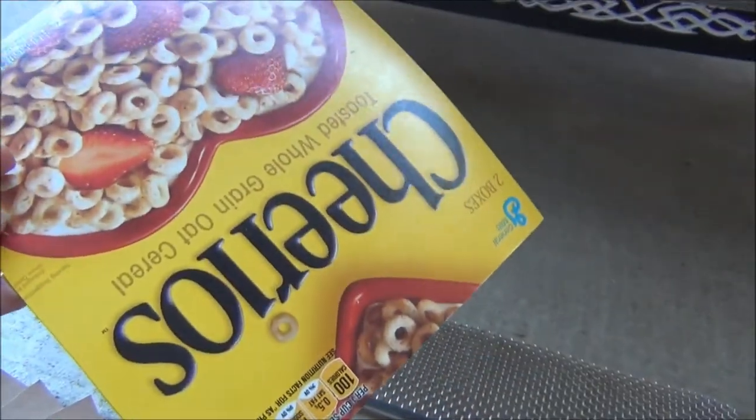I don't know if you can see in here, but there's a metal bracket — you can see my finger in there — with holes in it. There's two holes; there's one down there and one here where you can see the tip of my finger. I'll make a metal flange that goes through there and out here a ways, out of aluminum. I'll make a template out of some cardboard — my favorite template material that I use even on my leather projects is old cereal boxes.